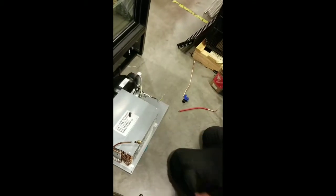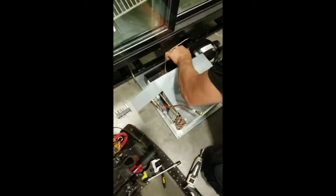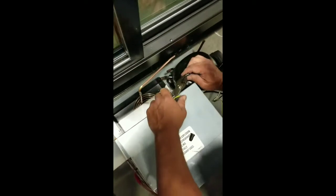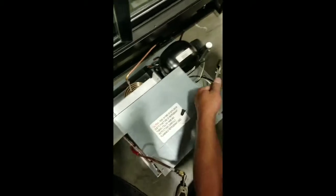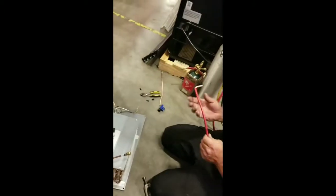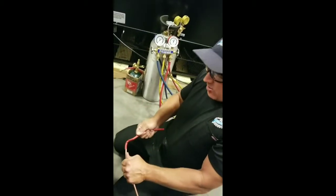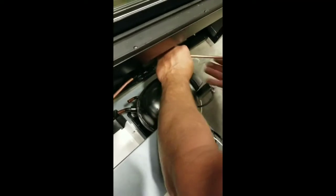And then on the compressor, we got two different parts of the compressor. We want to make sure the compressor is vacuum packed. Uh-oh. Listen to that. I didn't hear any bursts. There's supposed to be air behind that. So we're going to slide the sleeve off for a minute. But we're going to need the sleeve on there to identify that it is an R290 system. Take this, sit that in the port.